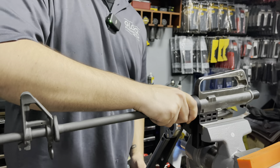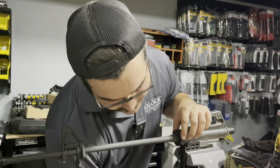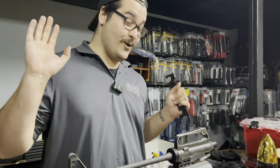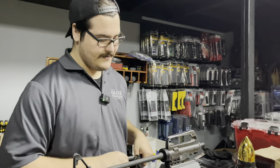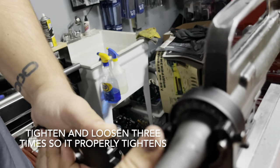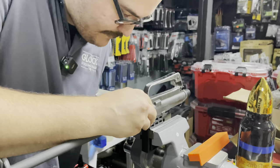That's 30 pounds right there. So now I've got to loosen her up again. I was actually planning on bolting this table to the floor, because a lot of the time when I'm torquing things or having to loosen a barrel nut, I need somebody to hold the table down. Because there are a few brands out there — I won't say any names — that really over-torque their barrel nuts at the factory and don't use any anti-seize. So I'm talking heat gun. If you're a car mechanic or know a car mechanic, it's just like having a stuck bolt — it's a nightmare. And then tighten it one more time, nice. That's 30 right there. Let's get her lined up, take her out of the vise, and we can go back to the front where there's more light and I can put that gas tube in.